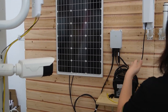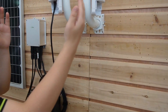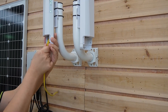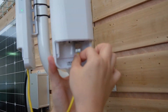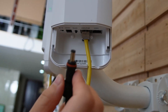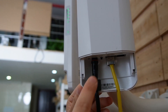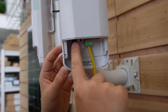So this pair is done. Now we are going to work with the other pair of wireless bridges. But first, we are going to connect this bridge back-to-back together using an ethernet cable — plug in this switch with this one. And then I am going to use another power output to connect with it. Remember, from our charge controller we have two power outputs — one for here and one for the bridge on the back. This one is on S mode.